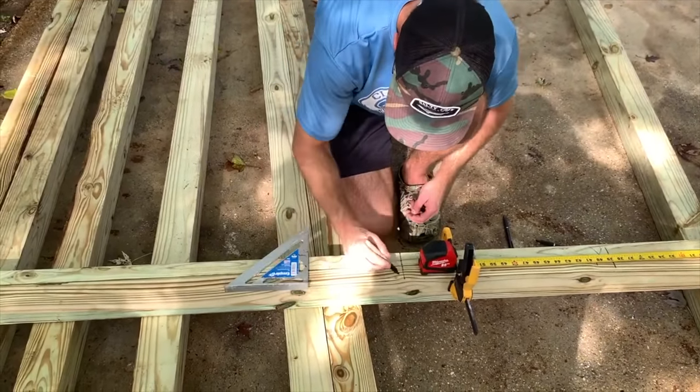Now, before lifting the roll-up door into place, you want to have the guides positioned against the left-hand jamb and the right-hand jamb as shown. You want to have a person positioned holding each guide, and then you want to lift it in place along the pivot point as shown. Here I am with my brother, and we're each going to grab one of the guides, and we're going to slowly lift the entire roll-up door into place.